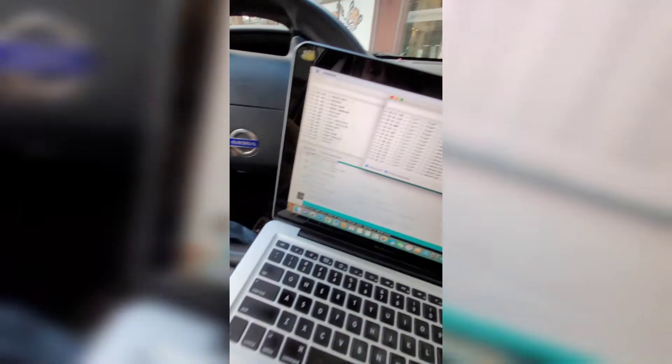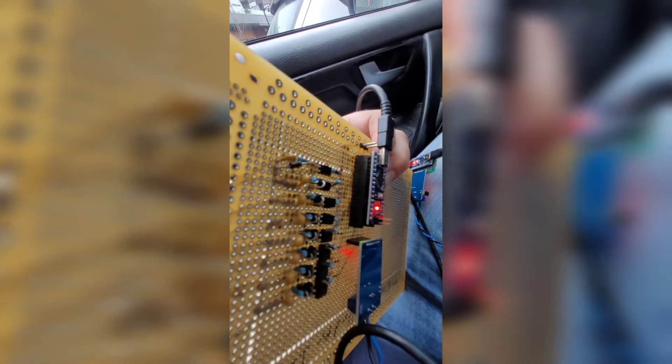As you can see here, this is the board I made with the opto isolators. It's basically taking in all the data from the opto isolators — when there's 12 volts applied it goes from one to zero, just have to know that for now. And then it's transmitting through CAN bus.